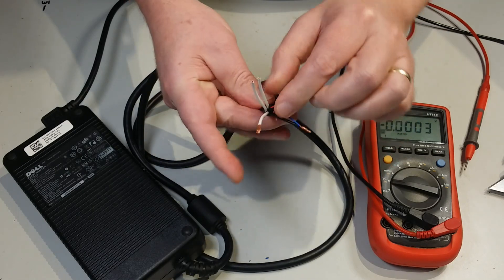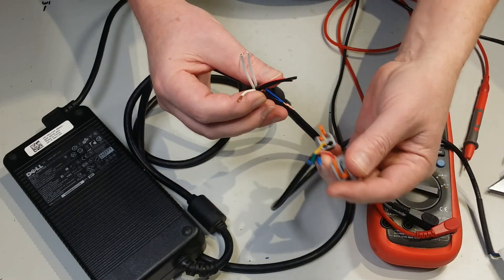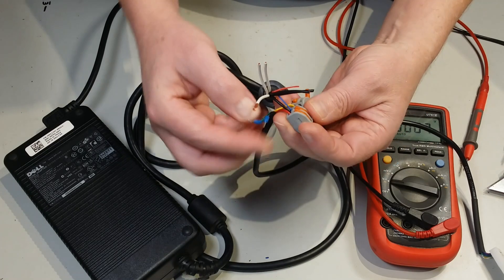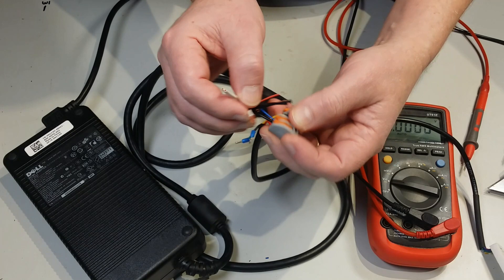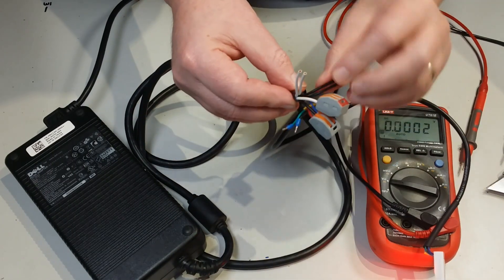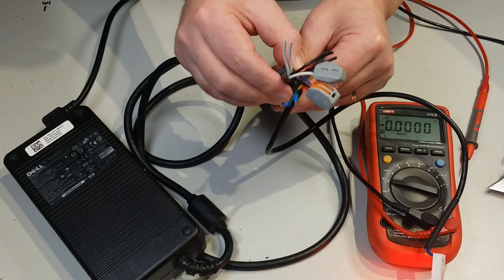Here I haven't bothered for this demonstration — I've just got some LED lights to show that it is outputting power. So we'll go onto the red, green, blue and positive there, hook that up, and there we go — 12 volts out of that. Pretty simple overall to hook up, easier than mucking around with that funny connector. That should be quite reliable up to the full 18 amps.